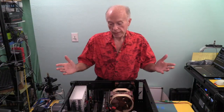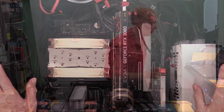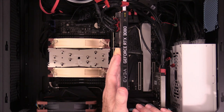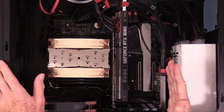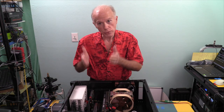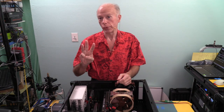For this first motherboard we've got about seven or eight talking points to go through, and we're going to do something a little different this time. Because we can take a look at a motherboard block diagram instead of just looking at the motherboard itself, as we've done with the Gigabyte TRX40 Designare — which has two 16-lane slots and two 8-lane slots, a GPU slot, and Thunderbolt 3. We're going to look at three block diagrams.